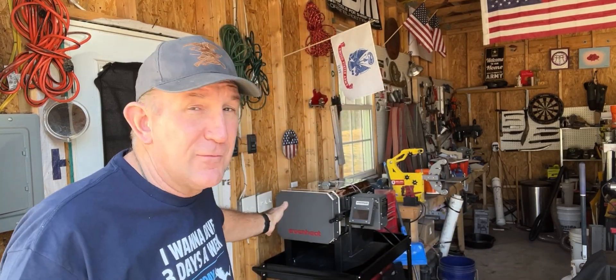Here it is out of the vermiculite and I got to tell you it looks great. I don't have all that scaling. I put the new Clay-Ore No Scale 2000 on it. We put it in at 500 degrees in the even heat kiln. It ramped up to the temp I set, and it's all about precision because we pre-program everything.